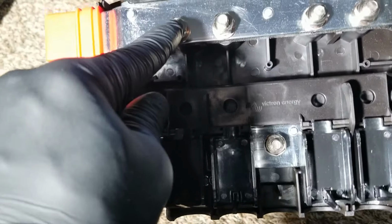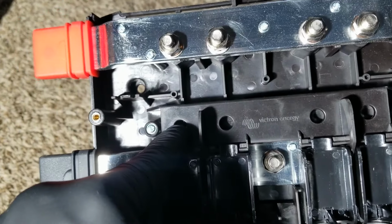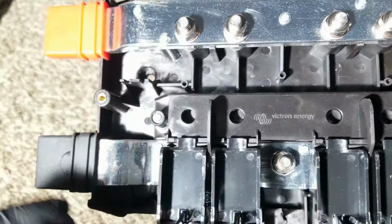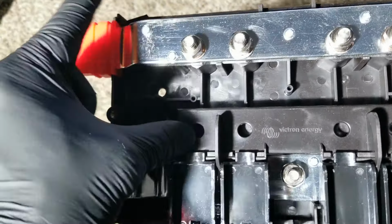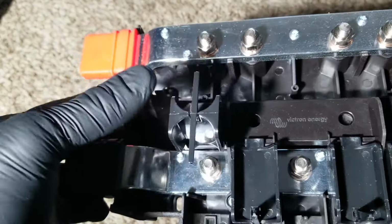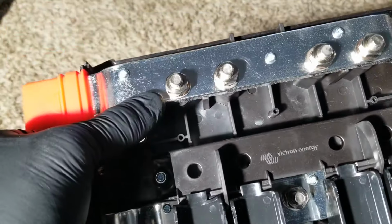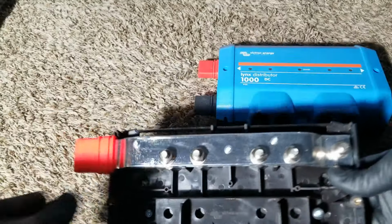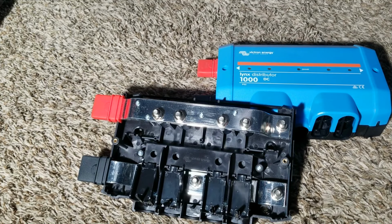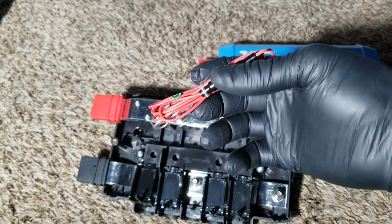But if you incorporate one of these bolts and nuts right here, you open this and you can put another stud right here to have your fuse come in between, in contact with your positive side, to hold the fuse right here. This one is tied to the positive, and you lift this one, the bottom is the negative. It even comes with small Phillips screws. You can do your small connections like this one, for example. If you want to use these fuses, inline fuses, you can incorporate any of these for your shunt.